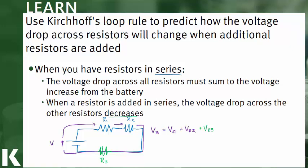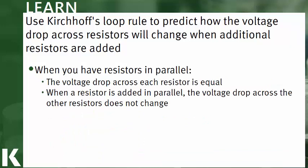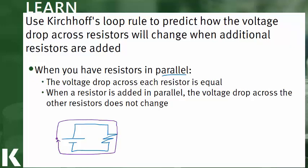Now let's look at how this is different when dealing with resistors in parallel. We start with a battery and one resistor. The loop goes from the battery through the resistor and back — one complete loop. If we add another resistor in parallel, notice that there is no change to this existing loop. Thus, whenever we add a resistor in parallel, the voltage drop across the other resistors does not change, because we are creating a new loop, not altering the existing one.